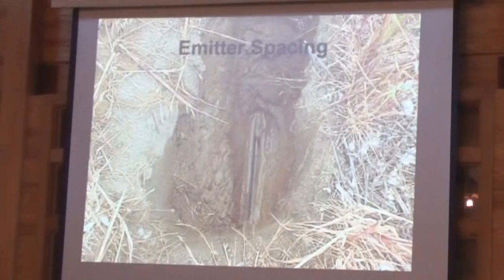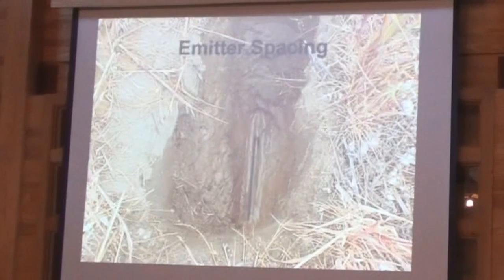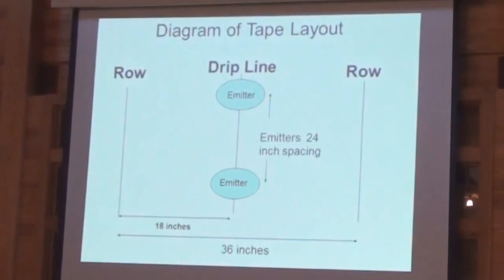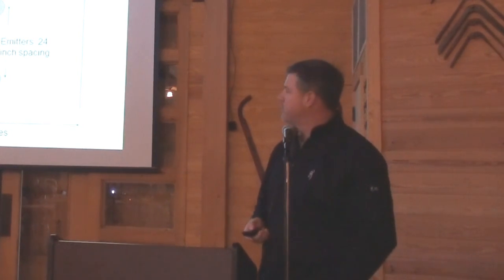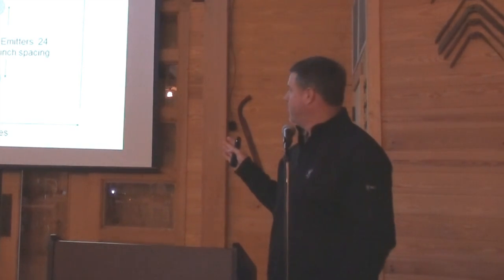Another thing is the emitter spacing. The previous speaker mentioned a lot of people use 12-inch emitter spacing for vegetables. Here, where we're using it, think about this tape every other row — you've got one tape serving two rows, so it's 18 inches to each row. We like to use 24-inch emitter spacing because the further apart the emitters, when the wetted zones run together they've had to move 24 inches, which is 12 inches for each emitter. Once they meet in the middle, the water wants to go down, and having moved out 12 inches toward the row, it's only 6 inches away from where you planted. The roots can reach that water and keep feeding those plants. That's why we like 24-inch emitter spacing every other middle.